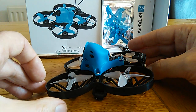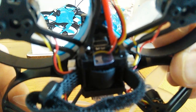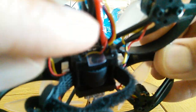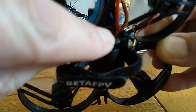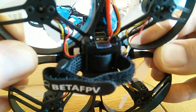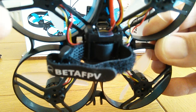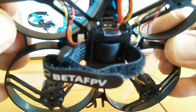That's the first thing, so do that. But also I've noticed almost straight away — if you look at that USB socket, you'll notice this little bit of plastic here. I've just shoved that in between the USB socket and the board, because that USB socket is really really close to two solder spots — that's the battery plus or minus. So if that USB socket gets pushed down or the board gets pushed up ever so slightly — it's less than a millimeter away — that will short out your battery straight through the board and the board will catch fire.